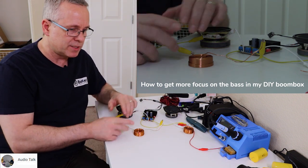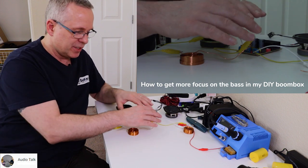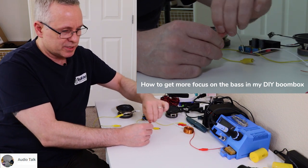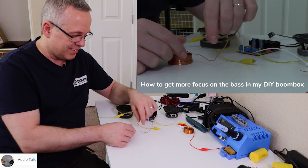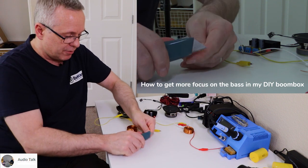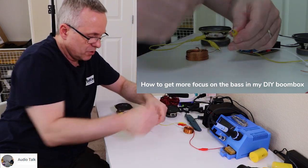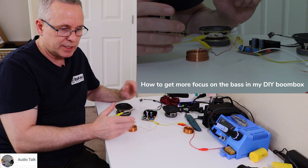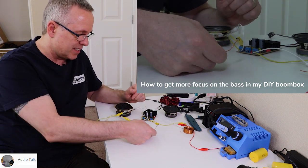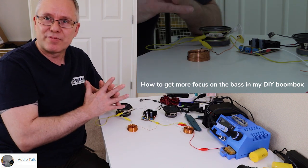Another important thing: if you find an old inductor where you have to cut the wire because something is old and dirty or has bad soldering points, just be aware that there is a coat on the wire. You will have to use a knife to shave it off until you have bare copper to make an electrical connection. Do that on both ends, because that coat is an insulator — it prevents electrical connection.